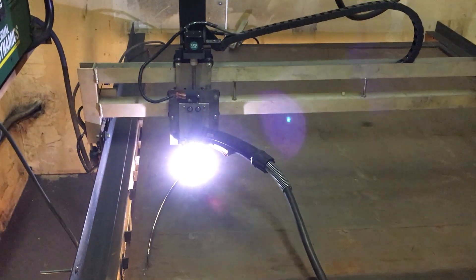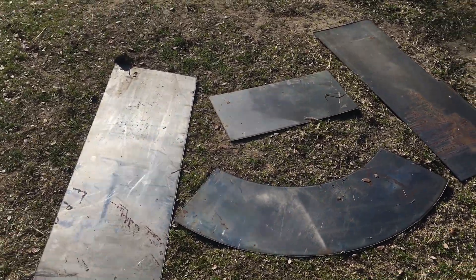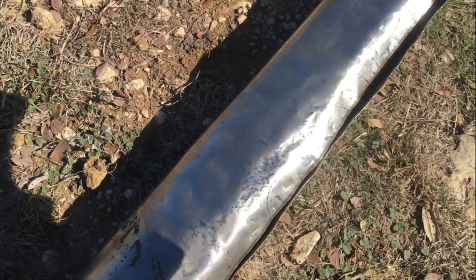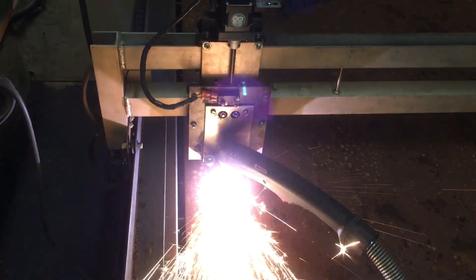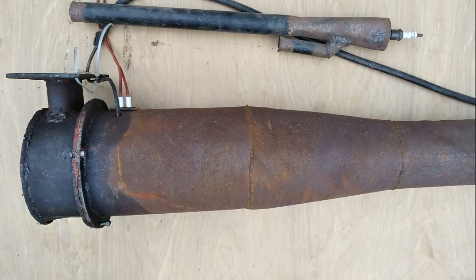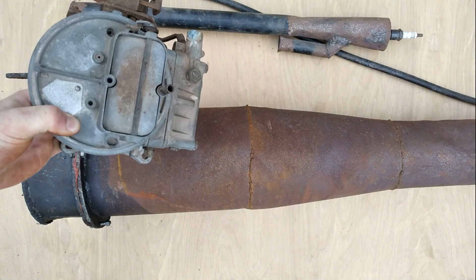To test out this idea, I decided to make a quick and dirty prototype. My goal for thrust was 100 pounds with a thrust augmenter, so without one it's designed to have about 65 pounds of thrust. The combustion chamber and tailpipe I plasma cut out of some 16-gauge steel, and the cylinder head and flanges are made out of 3/16 steel. You may have noticed a plate sticking out of the head — that's because I planned to switch from propane to gasoline, and I was too lazy to build an atomizer, so my plan was to just use an automotive carburetor.